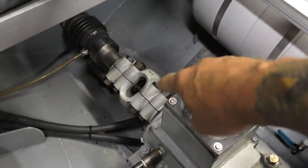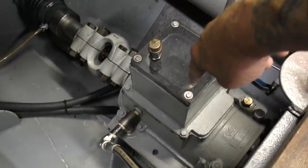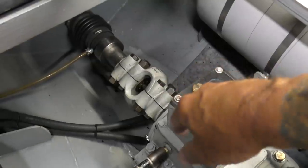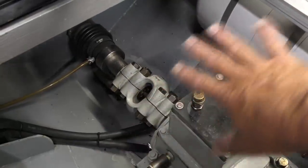I'm going to change this again so that I have some pitch on the blade even when the variable pitch control gear has failed completely — because I've lost a power steering pump or broken a hose or something else. I'm going to leave some pitch on the blade so I can move the boat. Pitching it to zero was a bad idea.